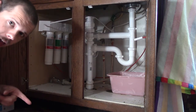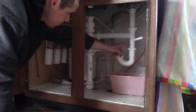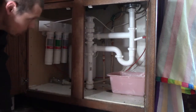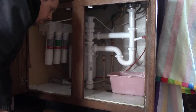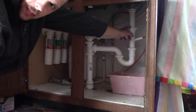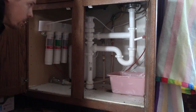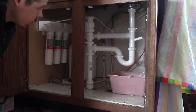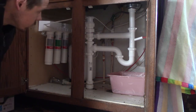The two biggest problems I had, and I'm not even joking about this: on these kind of pipes, you've got this little washer piece, kind of beveled on the one side, and you slip it up onto the pipe, and then you have the nut piece that actually screws to the next pipe. I kept putting that little silicone washer piece on before I put the nut on. You have to put the nut on first, because it needs to be on top of the silicone washer so it can screw down and lock together. I must have had to pull things apart 5 or 6 times because I put that silicone washer on first. I was like, oh, whoops. Gotta put the nut on first. Pull it off, put the nut on, put it back on. So that's a good thing to keep in mind. Put the nut on before you put the silicone washer on.